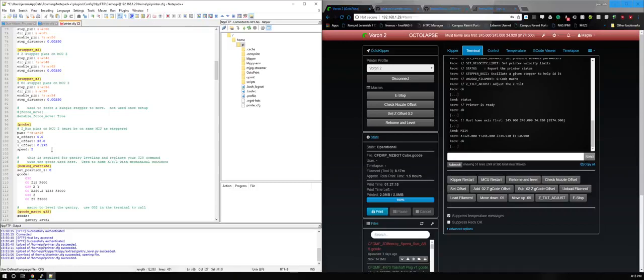But basically, you're going to have an input, a V+, a V-, and then a switch. It's three wires. The V- could be called ground or GND. The V plus could be called VCC, whatever, but it needs to be above 6 volts. So you cannot use the 5 volts coming out of your end stop pins. You need to use something else. I use 24 volts to it with the Schottky diode.